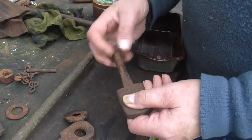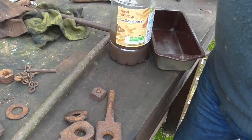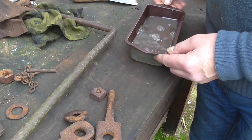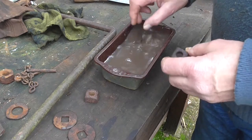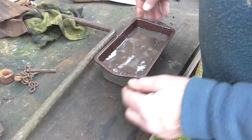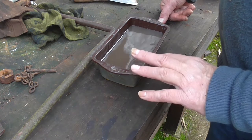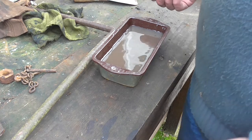In case you're wondering how I'm going to clean these rusty old fittings up, here's the answer — Sainsbury's vinegar. Well obviously it doesn't have to be Sainsbury's, any vinegar would do. If you put vinegar in a little tray like this and then take your rusty parts and pop them in the vinegar — I'll put the nuts in, I'll put these two washers in — and if you leave those in the vinegar for several hours you'd be amazed at the results. I'm going to leave them in there overnight. When you first take them out they look just as rusty as before, but if you wash them off and get a little brush and rub them, all the rust will come off.